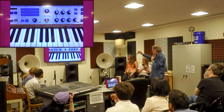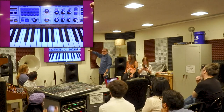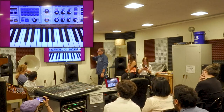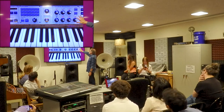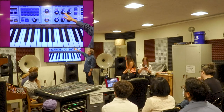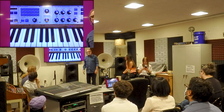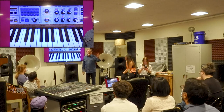Okay, and then data entry buttons where you could program stuff. Show you later. Ability to tune the instrument like you can, when you want to tune your violin, you could tune the instrument to whatever you're playing. And time scaling, you could make everything go a little faster or slower, depending on you might have pre-programmed different time values. And then the basic parameters, parameter articulation. So there was, and these are offset knobs. So these are the main parameters for the sound synthesis, pitch, FM frequency, FM index. And this was, of course, in the time of the very controversial purchase of the FM patent by Yamaha from John Chowning. That's a long story. I can tell you a lot about that.